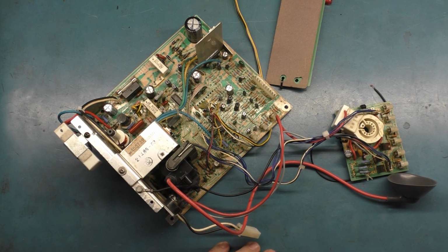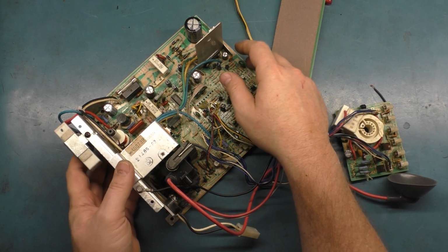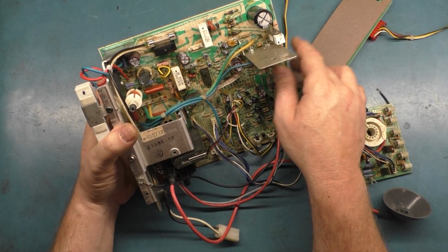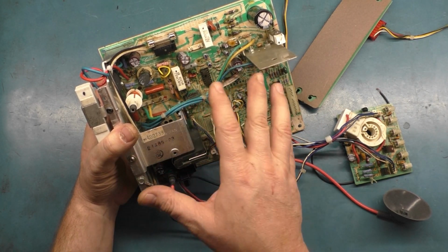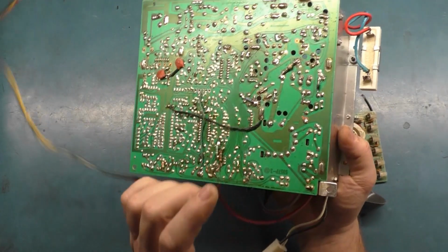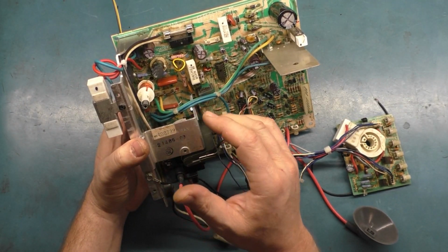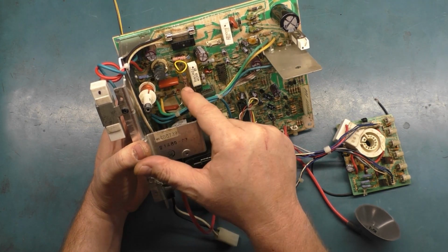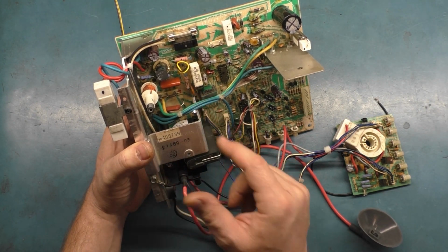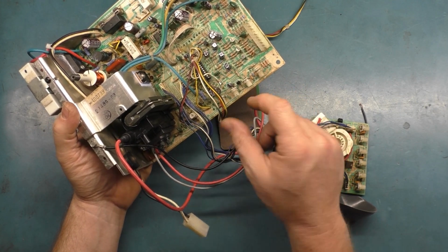But the problem was that I was testing it on a U5000 tube, and off camera I put it back on a 7000 tube, and it was way too wide still. So I was like, you know what? I decided to go ahead and put this back to original configuration. I put everything back. I took the 1.6 kilovolt capacitor off. I put the 0.39 width cap, C38, back in, and just went ahead and turned these pots down to a safe level.